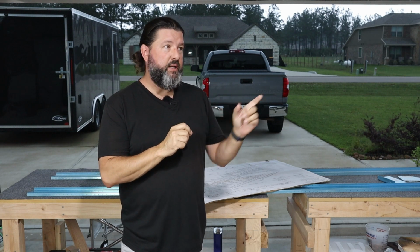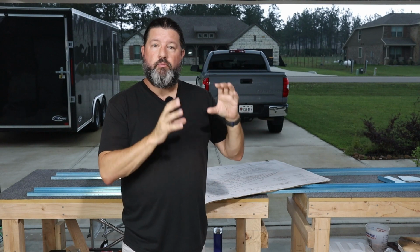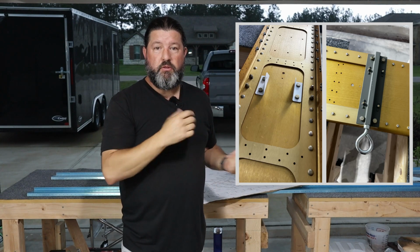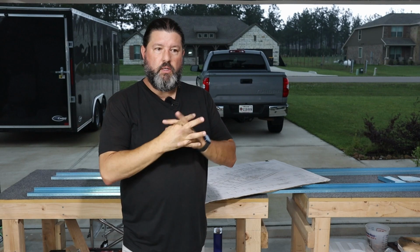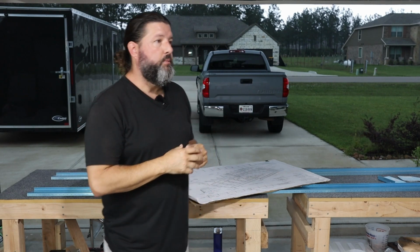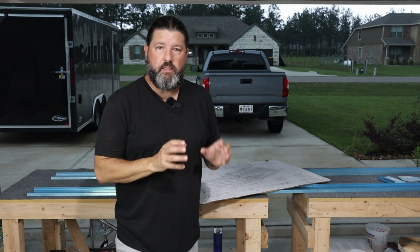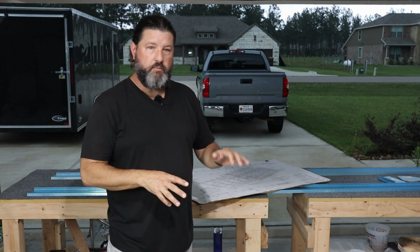Yesterday I finished up the tie-down assembly and got that bolted with the bell crank brackets onto the spar. It looks like this. Pretty happy with how it turned out. I did have to do a little bit of learning about torquing bolts into nut plates, drag torque, stuff like that. But anyways, that's done, which means I'm moving on to the rear spar now, and today I'm hoping that I can get all of the rear spar components prepped and primed.